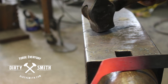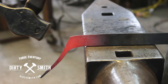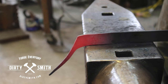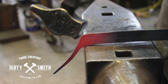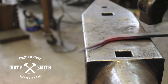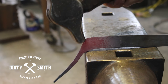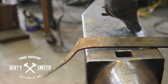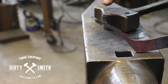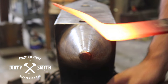I'm cleaning it up. Kind of putting it in the air, and I have my hand against my hip that's backing it up. It just doesn't take much to do that movement. Keep it clean. I like this sharp corner here, I like this gradual taper here, I kind of like the swell going on here. The next step is to go to the horn and turn this eye to make a hook, starting at the tip.